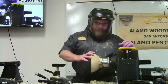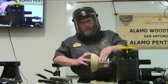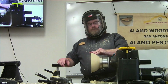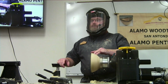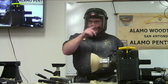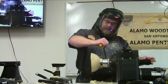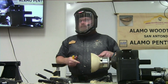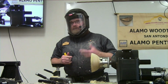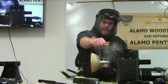Okay. Now, right now, this chuck is biting at 8 points around the jaws. And I don't care what I do, I'll turn this down a little bit. It's not running true. It's not perfect. It's not as true as it would be if it was a tight thing. Now Chad's one of our younger gentlemen here, looks like a strong strapping guy. He came up here and tightened it as much as he could. And I could still get more out of it, because those corners have now relaxed, the fibers have loosened up, and it's gotten weak. And that's going to happen on your bowl no matter what you do. Stuart Batty will even talk about it. I've watched him talk about that in a demo.